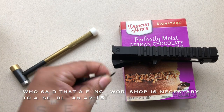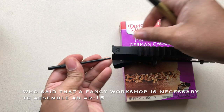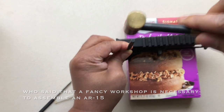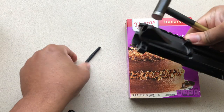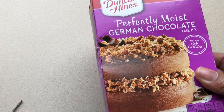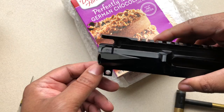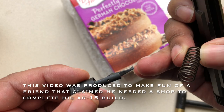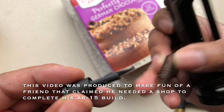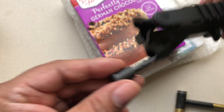Take my roll pin starter, take my roll pin, drop it in place, get the roll pin lined up. As you guys can see, we get the roll pin started, but I need something to bring this up even higher. Now that we have the roll pin started, as you can see, this forward assist has a hook shape on it. What you're going to do is take that hook shape and insert it facing the inside of the upper receiver.